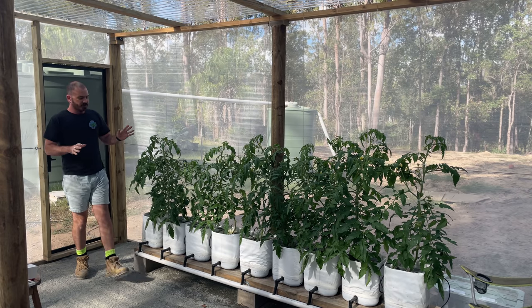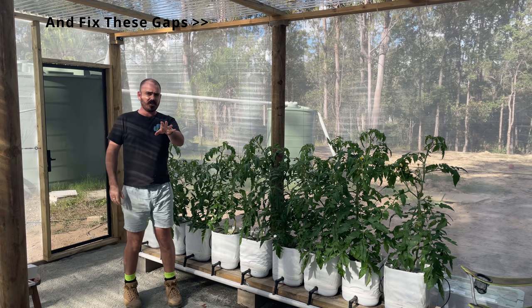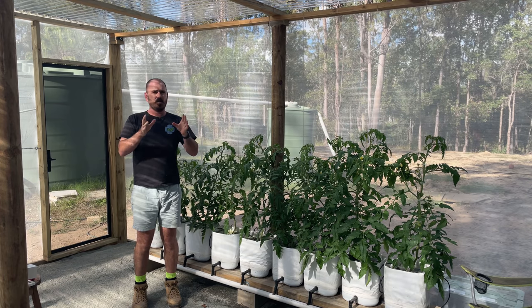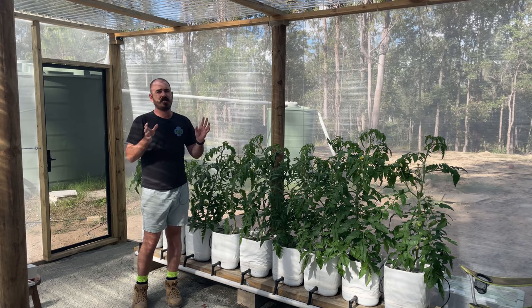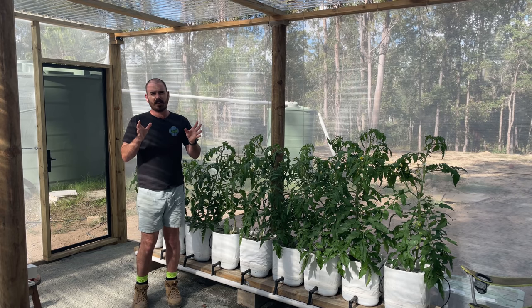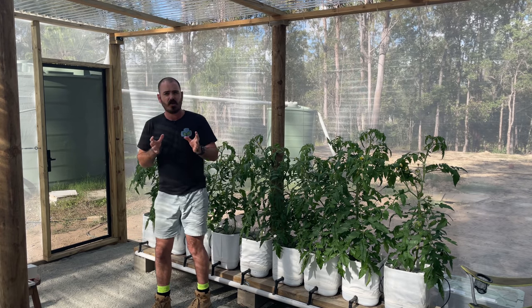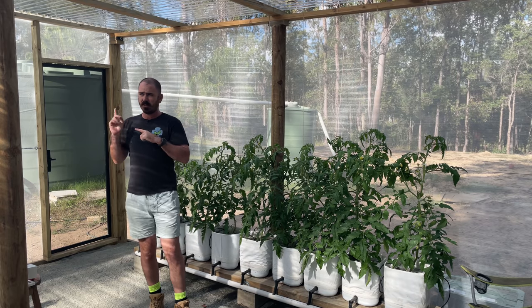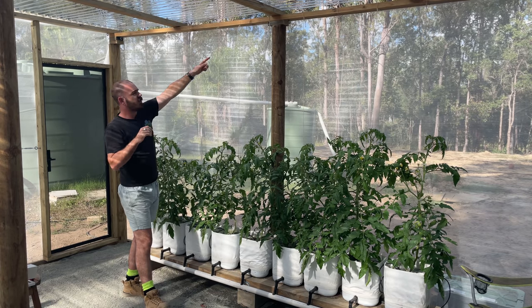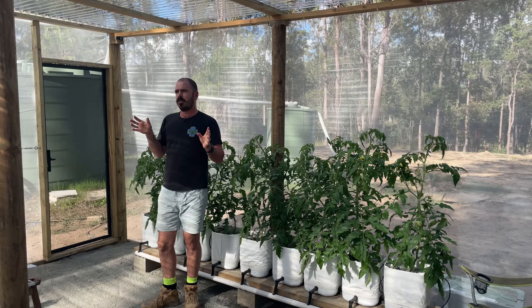It's not quite finished yet — I've still got to install the guttering and the tank. There are a few things I'd encourage you to change if you were planning something like this. I would definitely slope the roof a lot more than I have. I didn't plan for this originally to have a hard roof, and now that it does I'm really happy, but I kind of wish I had factored that slope in from the start. I've got some chucks in the corners to give it slope, but I would definitely pre-plan in more slope. Also, because of the weight of the roof, I would have made these top beams larger so that there would be no bowing — there is a little bit of bowing and I'll just have to wait and see how that goes.